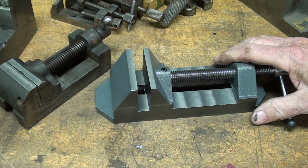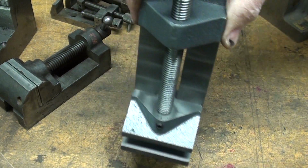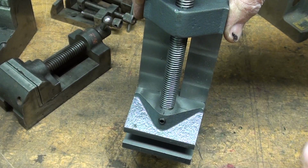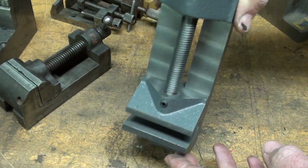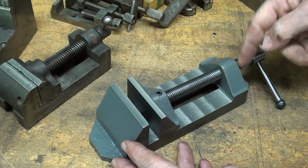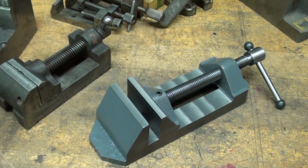I didn't get any comments at all on the setup that I use for drilling and tapping the hole, or any notice of how terribly, terribly important that setup is. Because if you don't drill that hole right here and tap it straight, you got nothing. You got scrap iron is what you got.